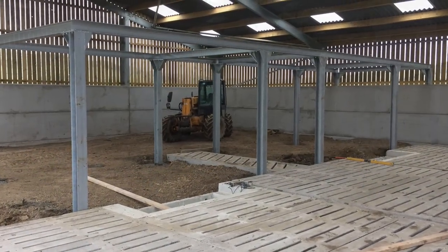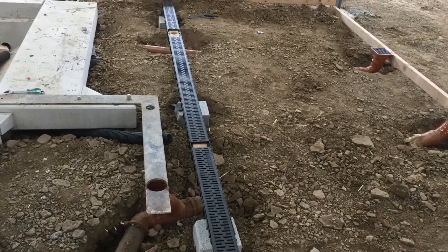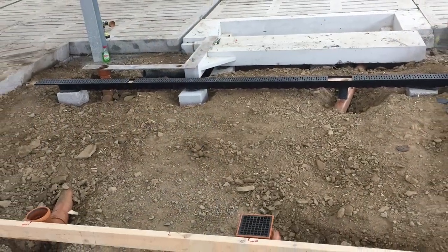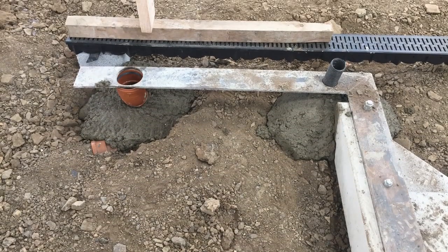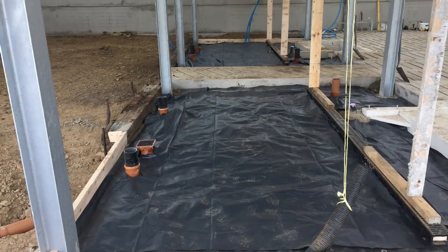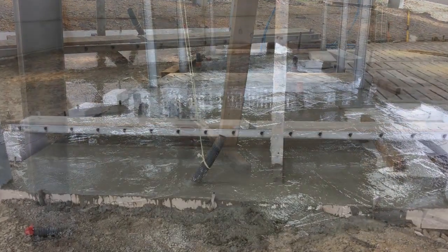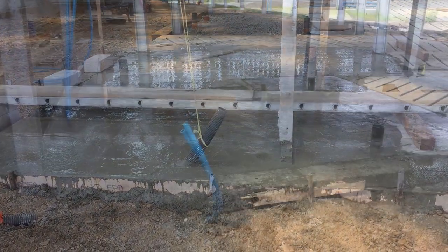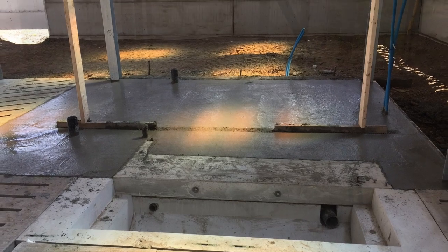Next came the construction of the robot rooms. This steelwork was made by a local engineer at Melvin Cars in Huddersfield. Things were really starting to take shape now. We had to lay the bases for the robot rooms, so we could build onto the top later on. Prior to that, all the drains had to be fitted first — this would make life a lot easier at a later date. A template was also used to get everything in the correct position. With all the drains in place, we prepared to lay the concrete floor for the robot rooms — straightforward shuttering around the edge, with a simple float finish at the end.